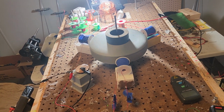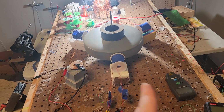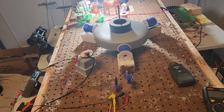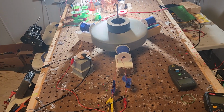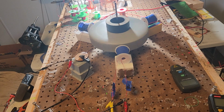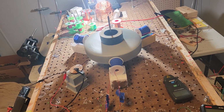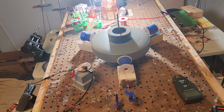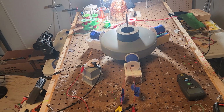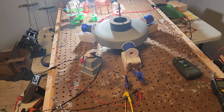Get what I'm saying? Right now it's like when the magnet passes, the switch will hit the side and it'll cause some resistance as the magnet passes, and then it gets released after the magnet passes. For that brief little bit of time, there's a magnetic load on the rotor, and if it's close enough, it can be really detrimental to the flow. Even though it's just a little screw on something very flexible, you can still slow it down tremendously, if not stop it. Not just because it's the switch, but because of the magnetic interference.